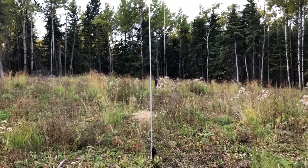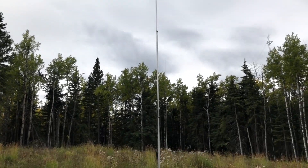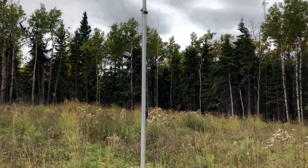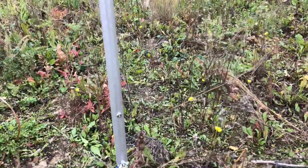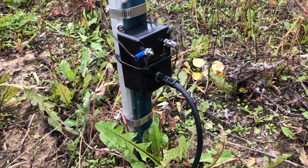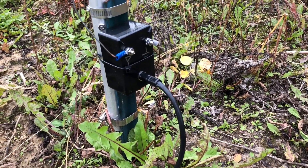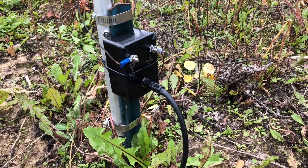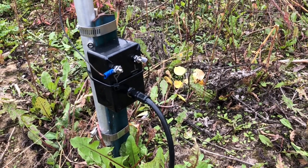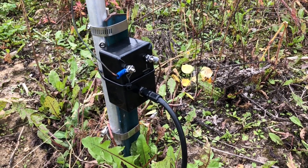Each element is basically just a vertical aluminum tubing whip made out of telescopic drawn tubing, hose-clamped together, about 25 feet high. I used a fiberglass insulator to split the element where the high-impedance amplifier is mounted. This is an op-amp-based high-impedance amplifier. I've redesigned this amplifier from the one originally supplied by DX Engineering. I've included a relay at the antenna terminals to try and avoid any damage from either lightning, wind static, or TX overload.